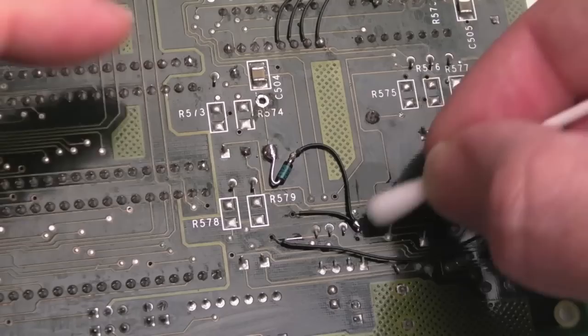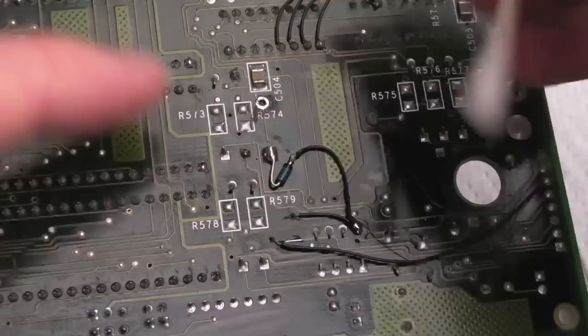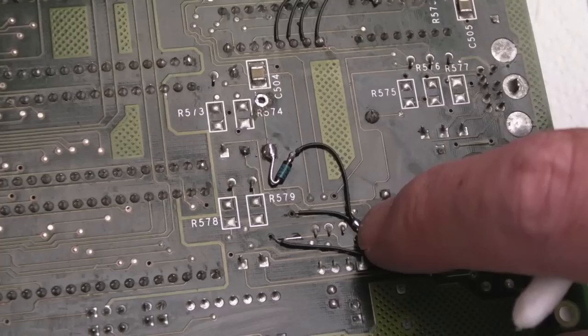So it was soldered to the wrong place, the diode. That's the first thing. You can see now its anode goes to the battery. The cathode wants to just literally go straight to the VCC pin on that chip, which is pin 8 there. That's all you need to do. It really is that simple. Wish I'd got the IPA, that one.